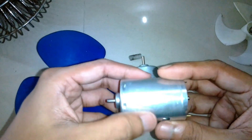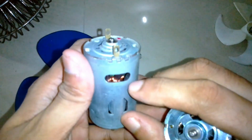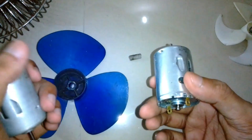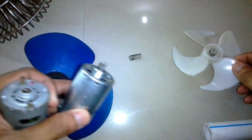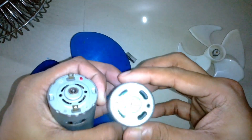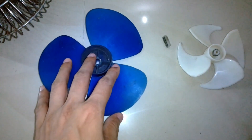This tire compressor motor is actually powerful — you can see the winding has much thicker wire compared to the thinner wire of the other motor. At full load it pulls about 75–100 watts, and at stall current it pulls about 36 amps, so it's very powerful. But every time I try to fit this fan on it the blade just comes off because the shaft rotates so fast. So I decided not to use that motor; instead I'm going to use this one, which is about 15 to 20 watts — pretty decent. Let's start building.